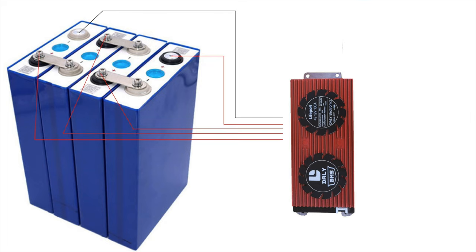So that's your main power side of things. Now we look at the monitoring side. This BMS will monitor each individual cell. This lead connects to the positive of cell one, and this one here monitors cell two. The BMS monitors all four cells and sees what charge levels are in each. What it will do then is balance: if one cell is slightly lower than the other three, it will bring that cell up to match the level of the others, keeping all four batteries at the same charge level.